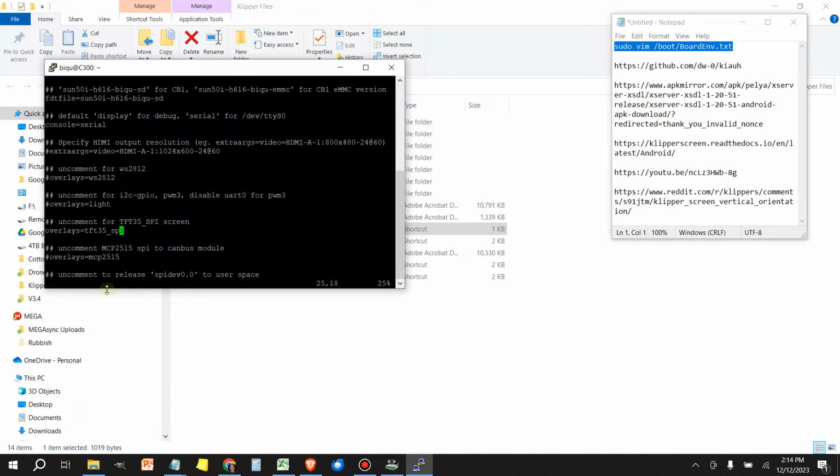Then you're going to press shift and then the colon. That's going to bring the little cursor down to the bottom. You'll see a little colon displayed there. What you want to do is save this. To save it, it would be W. To save, press enter. Then you'll get a confirmation here at the bottom that says however many characters were written.